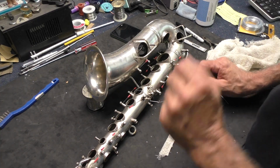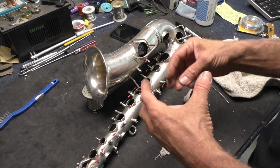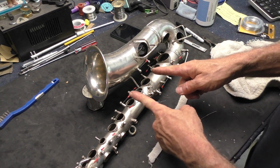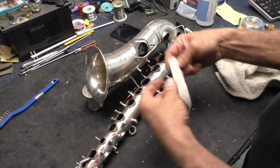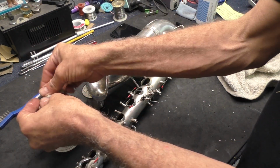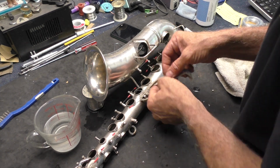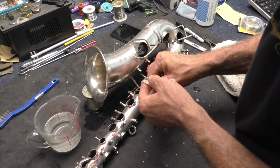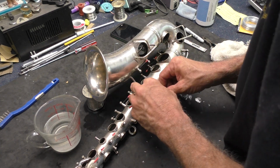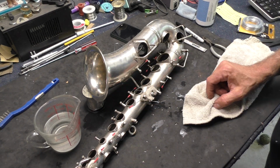Now, years ago, I did some work with some copper where I was working on some architectural elements that went on a building, and there were things, you know, brazed together. Well, it was actually copper, phosphor bronze, gas welded together, and there were things like within 2 inches of each other where I was working on one joint and I had to keep the other joint cool. I found that just terry cloth towels, torn up, cut in strips, whatever you want, put a little water on that, get it wet, and if you just kind of wrap it around things nearby that you don't want to get hot enough to actually start melting their welded joint, whatever the material may be, solder or otherwise, the rag will help to dissipate the heat via having to warm up all of this water. So I'm just going to wrap things up all around here with pieces of wet rag.